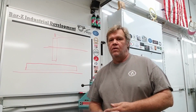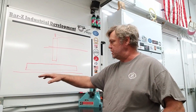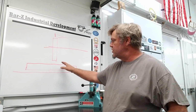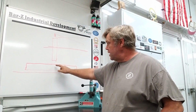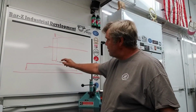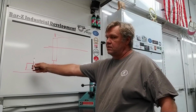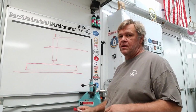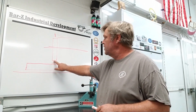Okay, what we've got here, this lower line represents the axis of the machine. This rectangle here represents your mag plate, which should all be equal, very parallel. And typically what we do is we just plop a diamond right here and traverse across the wheel, and that's automatic. It makes it parallel with the machine, and your wheel is dressed perfectly for doing flat work and flat grinding.